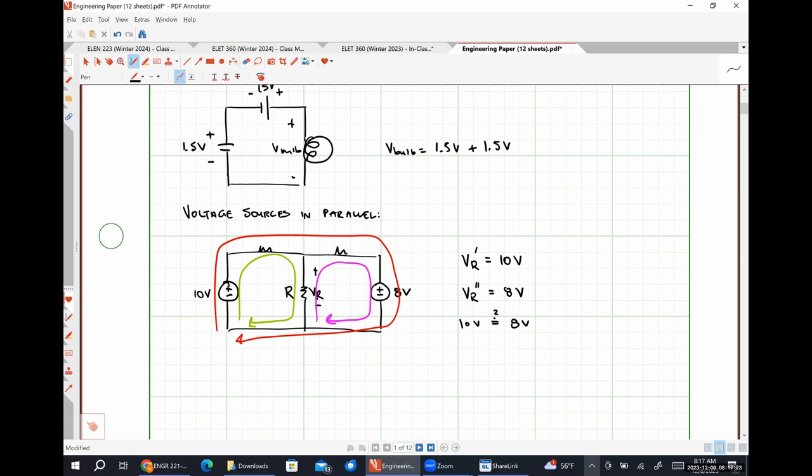Okay. So for our intents and purposes in this class, where we're assuming that all wires have zero resistance, if we ever were given a circuit like this, we literally cannot analyze it. You just have to say full stop, can't do it, things are broken, not my problem. In practice, like I said, Camden is 100% correct in that the thing that will make this work is the internal resistance of the wire, kind of balancing everything out.